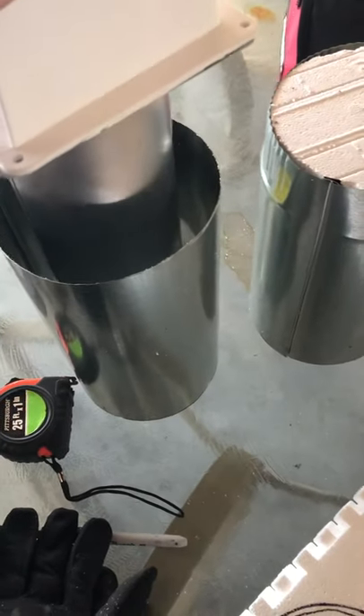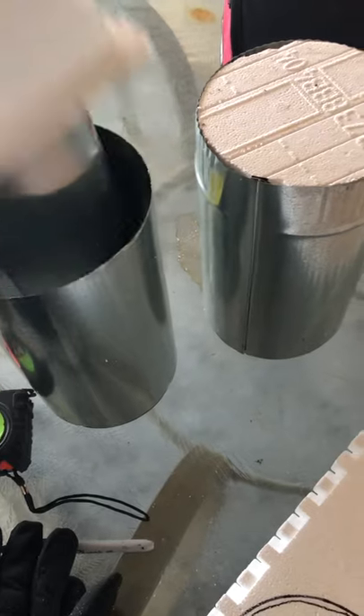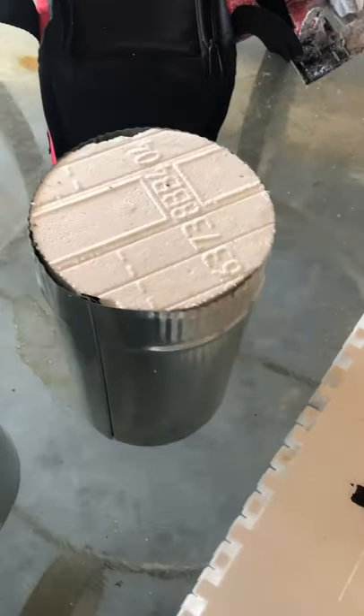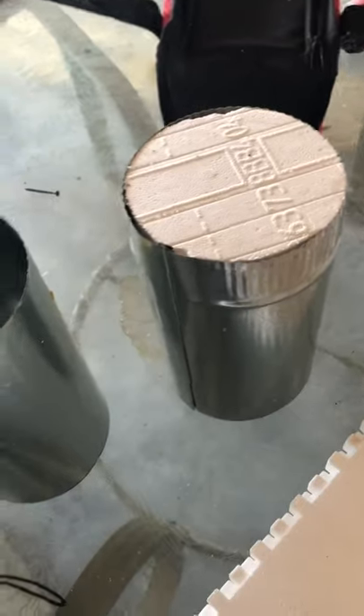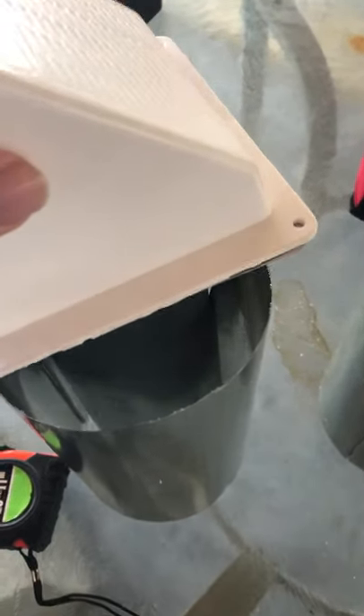What I want to do is just try to be smart about this. I got some steel, galvanized steel, normal ducting. Just plug it right here — I'm going to get it taped up. That will go inside the ICF core to pour around it, and then you'll have a metal liner with about an inch air barrier. You can probably even sneak the dryer metal line over that pretty good, so it seems like a pretty robust setup.